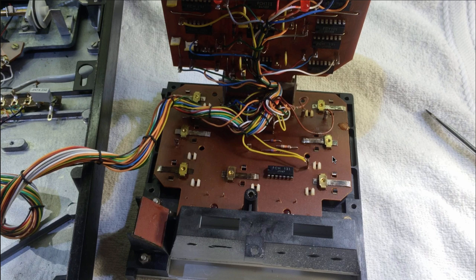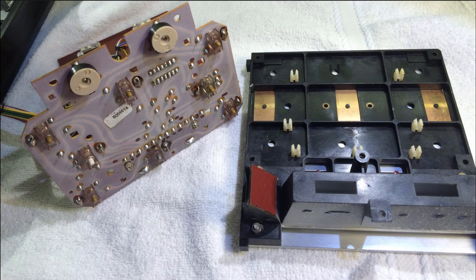To remove the terminal, I had to remove the printed circuit board because the solder points are underneath. The board is held to the keypad by seven white plastic clamps, which is a little challenging because one has to press them together all at the same time to lift the board out. Since one only has two hands, you do this one after the other, clamping them, pressing the board up, and supporting it while doing the next one, working your way around until all are pressed together and the board can be lifted up.